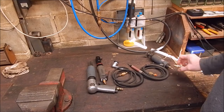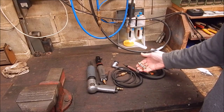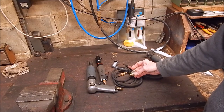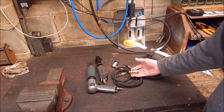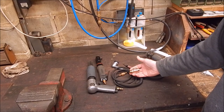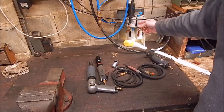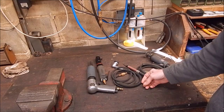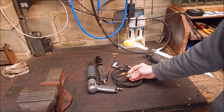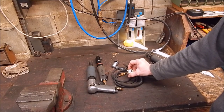I did see a guy comment the other day on a forum about these cheap in-line oilers — you get them quite often with little air grinders and things like that. My advice is don't use them. They're total rubbish. His comment was, well, how do you adjust them? The answer is these simple ones you can't adjust whatsoever. You can get some that are adjustable but they're more expensive and still pretty primitive. Don't use them — they'll just put gallons more oil through the tool than it needs and make a huge mess.